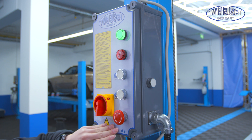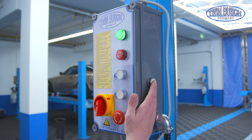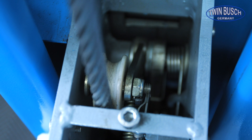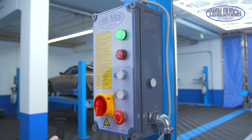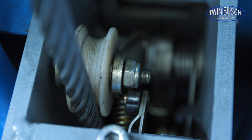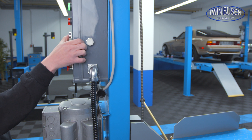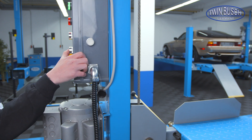Additionally, the 436 P and the 436 PD2 have a small button on the side for the so-called slack cable protection. This is a system that monitors the steel cable tension and constantly makes sure the lift doesn't tilt. If the lift were to tilt, one side of the cable would lose tension; the lift would detect this via a limit switch and stop immediately. In that case, I would push this side button while lifting up until the cables are taut again, after which I can move the lift normally.